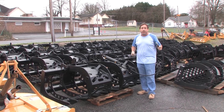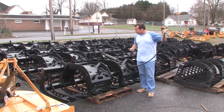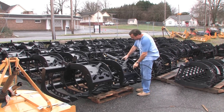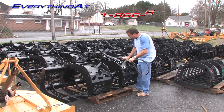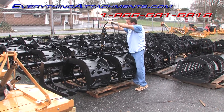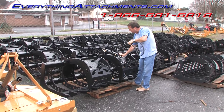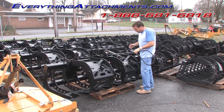Just to make it simple, we thought we'd pick up the heaviest grapple we had here on the lot with one piece of hose. So we're going to move the forklift in, I'm going to tie this around the fork and see how this JIC does. I plumbed it to give the JIC a fair fight, so it'll go straight up and pull in its strongest way possible, same way I'm going to do the pipe fitting. We're just going to use one hose on a 960 pound grapple and see what happens.